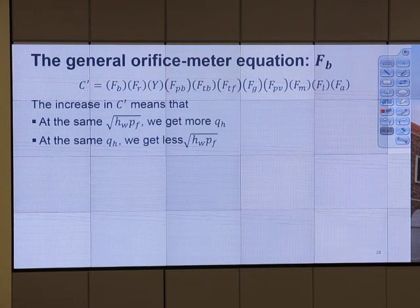Coriolis flow meter, just the meter itself, can range from $1,000. $1,000 gives you a very small one, like this small. It doesn't measure much flow rate. If you want high flow rate, like what I have in the lab, $16,000, or very high flow rate, it will be $60,000. That's usual for a Coriolis flow meter. Very expensive. Compared to that, if we have more flow rate with an orifice plate, you just change the plate to one with a larger hole. It's cheap. Oh, I should not say cheap. Less expensive, more economical, better.